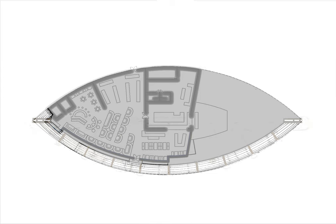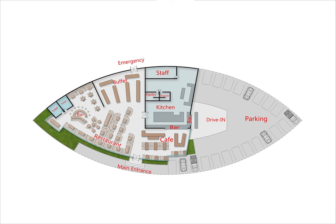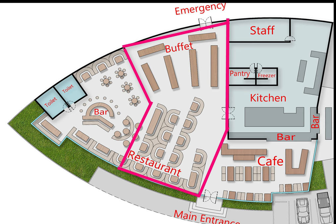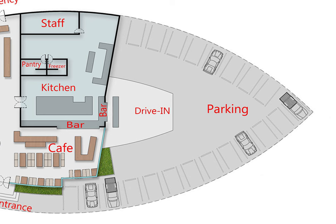The great benefit of the roof construction was that walls or internal pillars were no longer needed, allowing one large open space underneath with floor-to-ceiling windows. Only the kitchen and toilets were placed in separated spaces. The restaurant was divided in three different sections without internal walls: a self-service diner with buffet tables, a lounge section with a cocktail bar, and a cafe section. The large kitchen had two openings — one towards the restaurant and another that opened towards the parking lot, which could hold 25 cars and was almost half the size of the entire building.